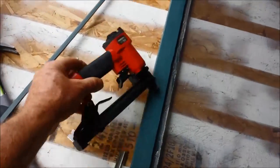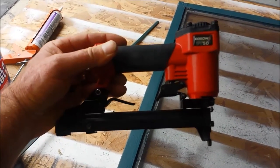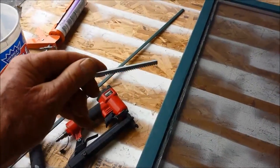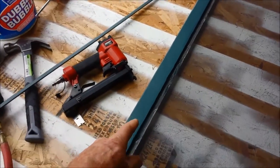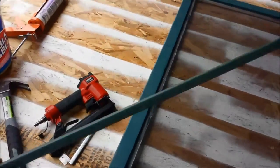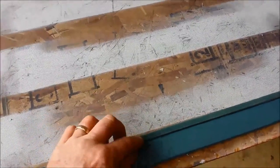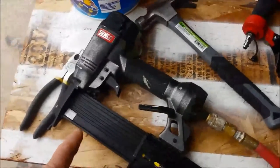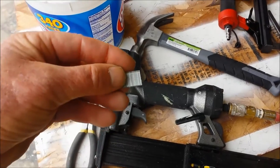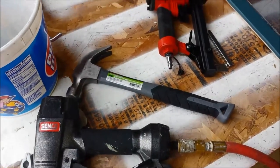This is worth purchasing - they're about 50 bucks, and if you're doing a lot of screens you need to have a pneumatic stapler. Make sure you get the right size staples; these are fairly short so that I won't go through the wood edge. When you put in the stop to finish out the frame, you use a pin nailer - that's a different machine. Here's my pin nailer with very, very short pins. That way it won't go all the way through the wood and create a filling problem.